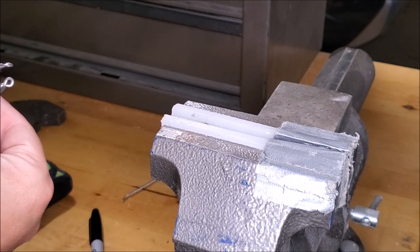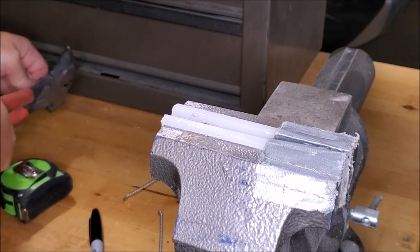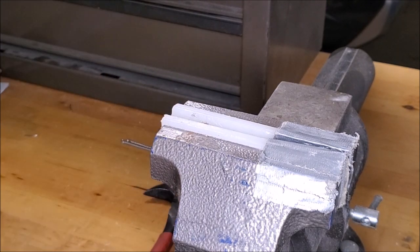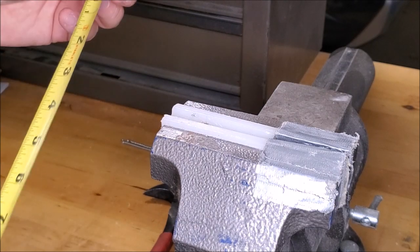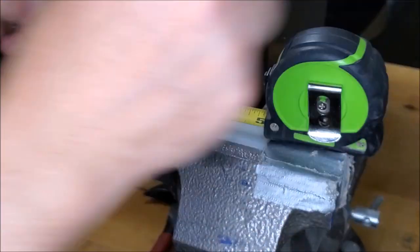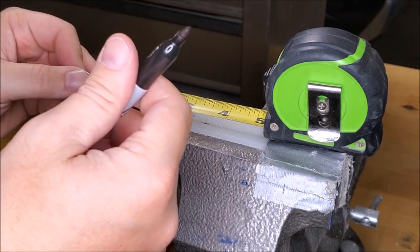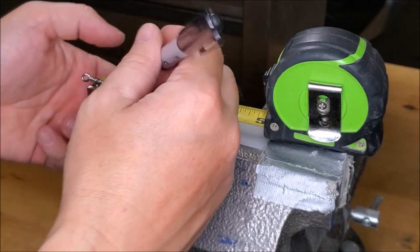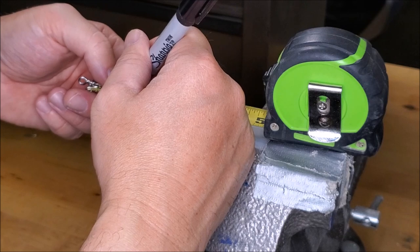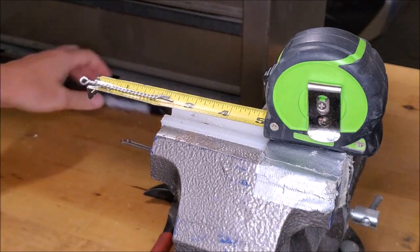Okay, so the front and back line ties I'm going to leave as long as I can. But the belly tie I need to leave a little bit shorter, so I'm going to make it 1.25 inches worth of embedment. That leaves me 1/4 inch so I don't go through.